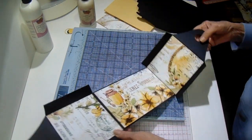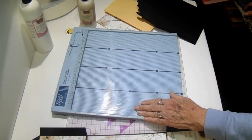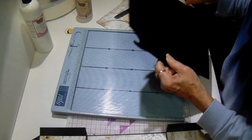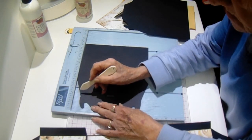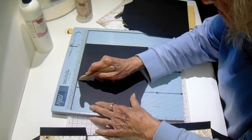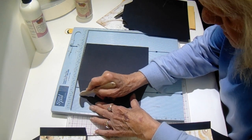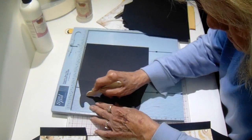The next thing we need is the two large pieces and they have to be scored. These should score roughly at one and seven-eighths and four. I'm going to have to move it down just a little bit to get it to score at four, and then when I move it down to make this match four, this one comes in right at two. So you score it across there.